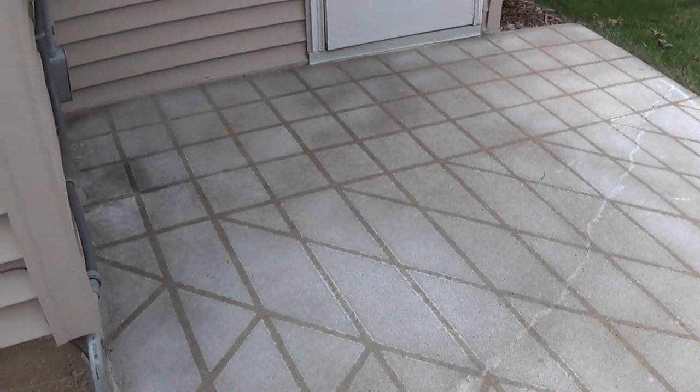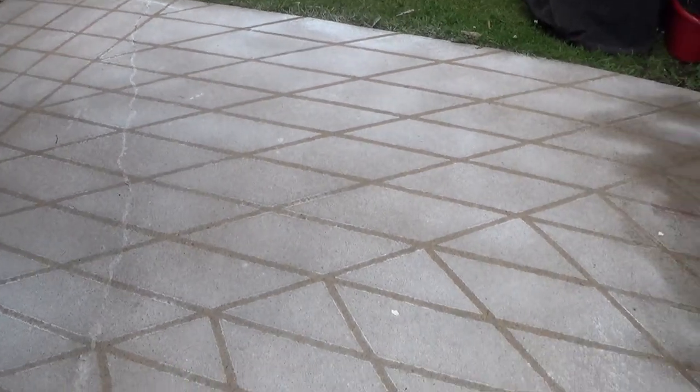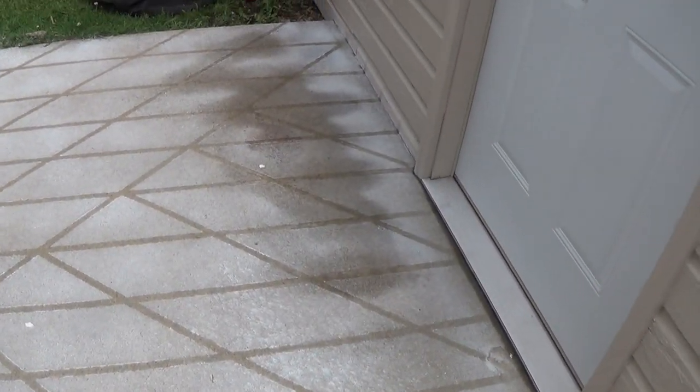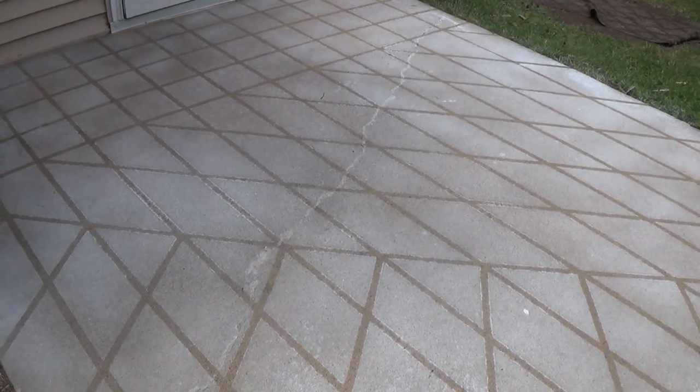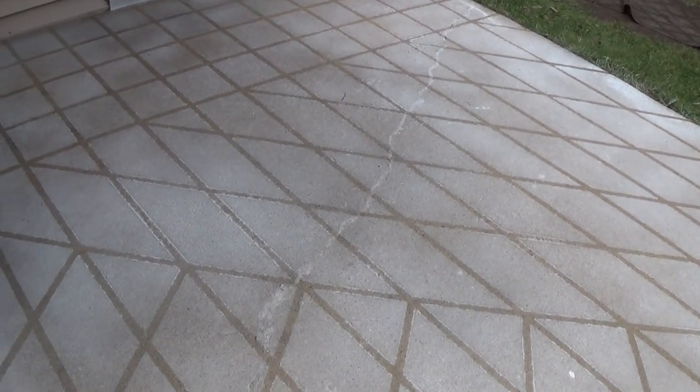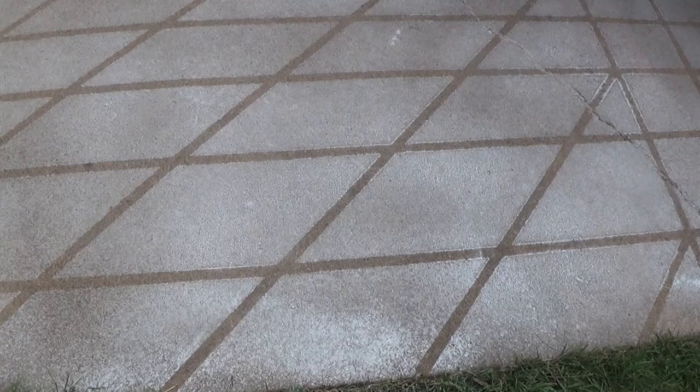I did pull the tape — ninety percent of it was all dried up enough to get the tape pulled off. I was hoping that would speed up drying in this area and let any moisture under the tape evaporate. Once you take the tape off, give it a good hour so any moisture that might have leached under the tape has a chance to dry up. Here's another tip: before you pull your tape off, you'll see spots where some areas are really heavily concentrated and other areas are lighter.